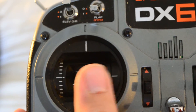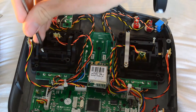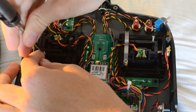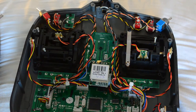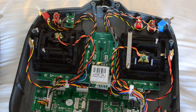That lets you adjust how smooth your sticks are when you're flying. Some people like them smoother, some people like them a little bit stiffer. I prefer to have mine pretty smooth but not so smooth that I just touch them and they move too much. When you adjust most gimbals, unscrewing these screws will make the gimbals looser and easier to move around — you want them set to your preference. If you have a transmitter that can adjust your gimbals, you should probably go in and adjust them, because it will make your flying experience a lot better. So we're going to move on to another radio and see what differences, if any, there are.